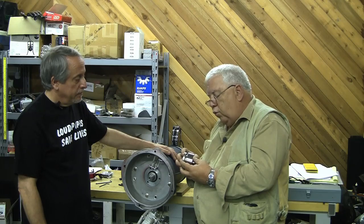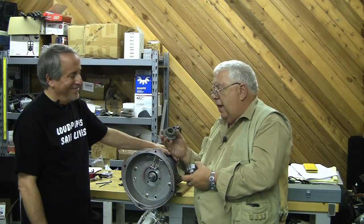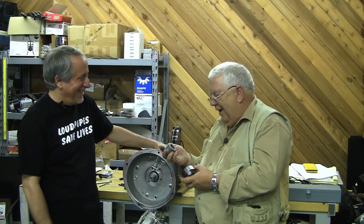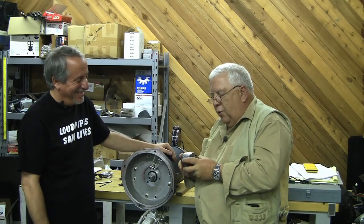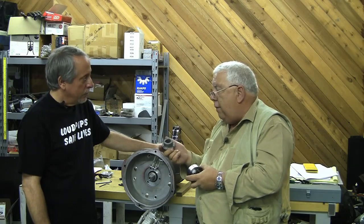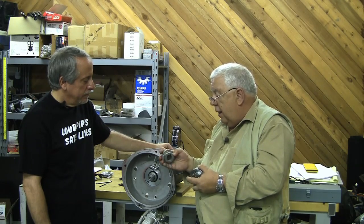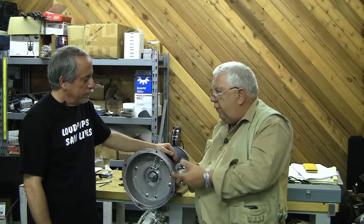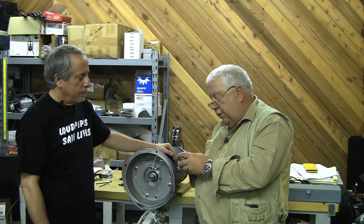It will drive this down and compress that taper lock. How else do we explain it? Another name for the taper lock — when we drive the taper in there, it compresses the ring around the shaft and gives us a great lock on it. This is all machined as part of the kit. You've got a little set screw to kind of set it on the keyway — that's mostly an alignment thing. Get it all lined up, squared up, then stick this on and put three bolts in, rotating a little bit at a time so you don't get it cocked. You want it to draw straight down on there.